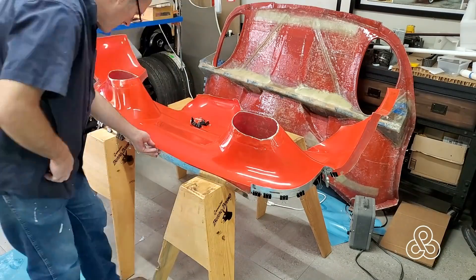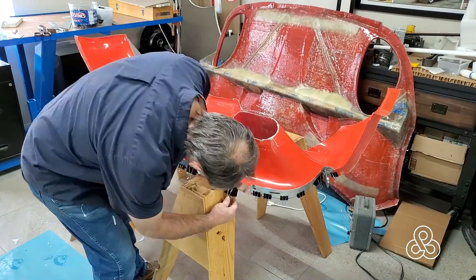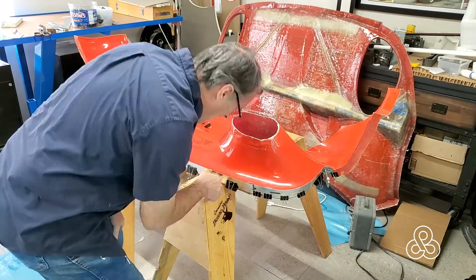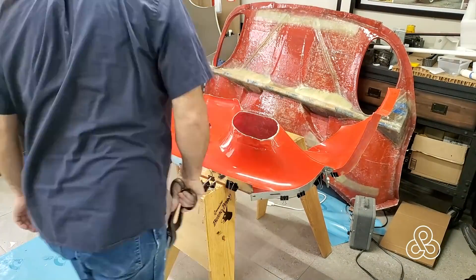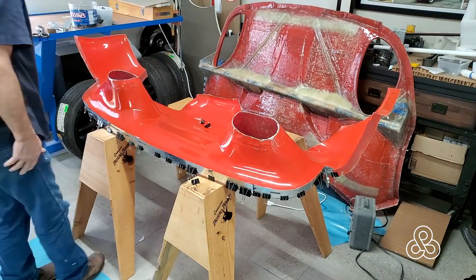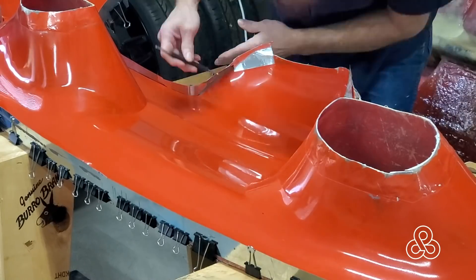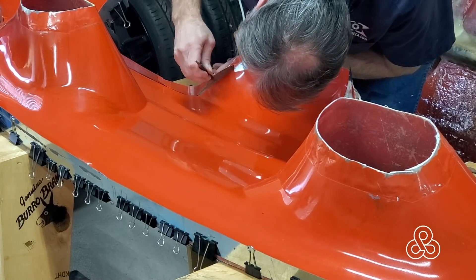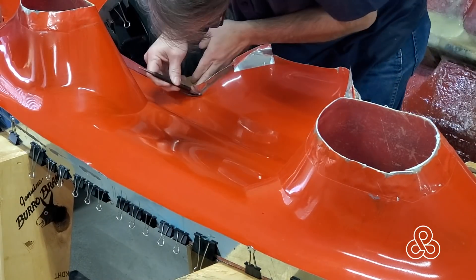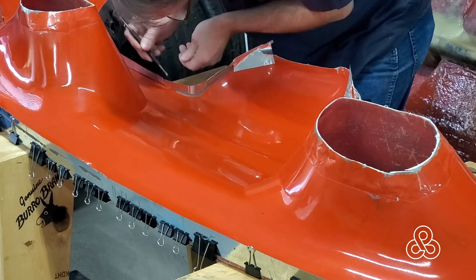Going around, I've got some pretty tight bends and some wild radiuses on this thing. That tight corner — you can see I put a C-clamp on it to suck it in nice and tight. Then going around with my paper-cut clamps, need a little more trim there to get it to close up. Once we get all the flashing on, it's time to go back and do our fillet around the corners, get a nice clean radius going around, and seal the edge so the resin doesn't go back behind the mold.